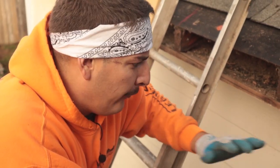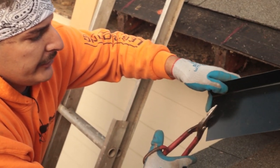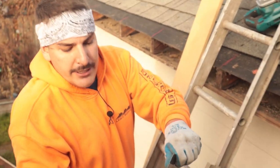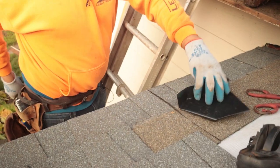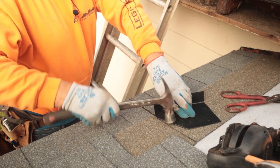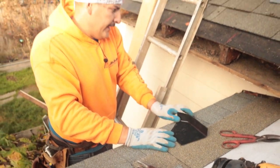Whenever your roof meets the wall, you need a kickout flashing — put it into the gutters. I like to make a nice big one: take this piece, tuck it underneath, and then bend this piece over. Hit it down with your hammer. The water essentially kicks out into the gutter instead of running down the siding, which you can see is the problem here.